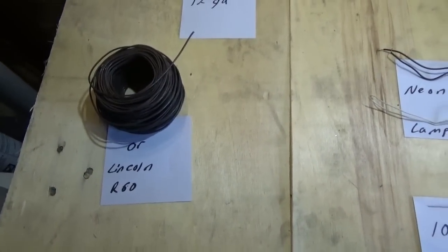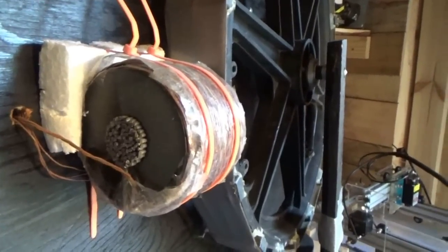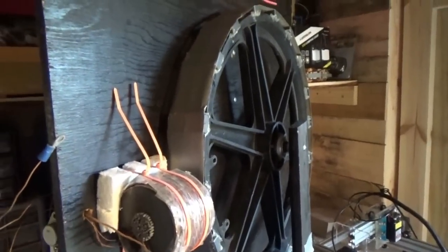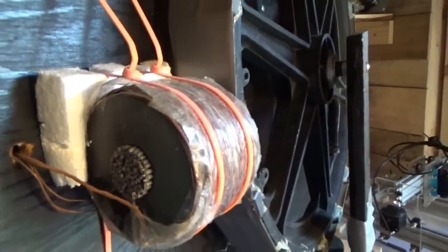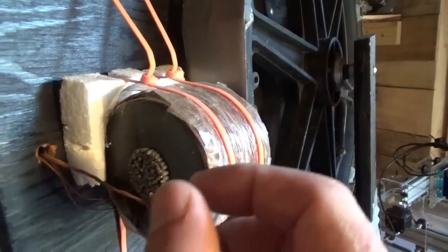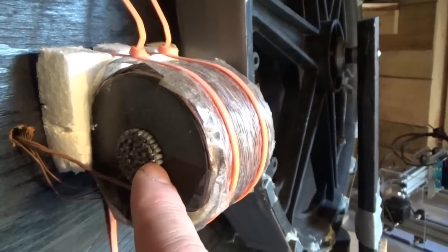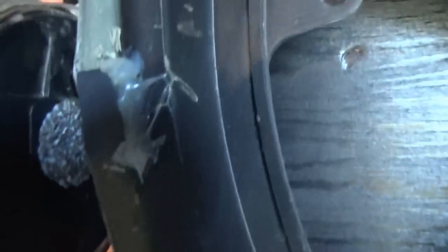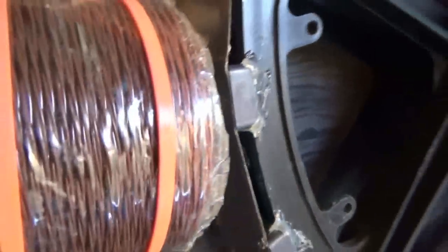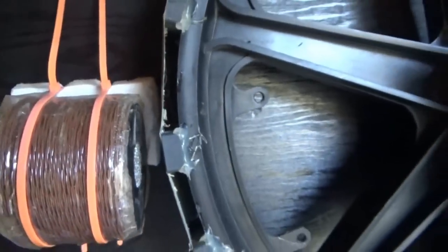Let me show you the spool. Here is one of my old coils on a more advanced machine. You can see I took standard plain old bailing wire and stuffed it in as tight as I could — you actually have to hammer it in. I first estimated how much I need, put it in loose, cut some extra lengths, and then spray painted them with primer. You want them flush on the end facing the magnets and cut close on the back side.